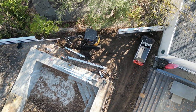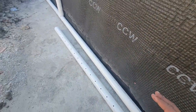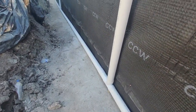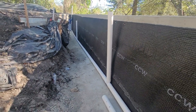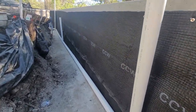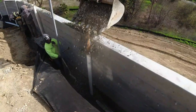So we got the perforated pipe here, and this is the SDR 35 pipe — this is what we use. We don't use that black corrugated pipe, at least not the commercial grade. We have a project coming up where we've got to use some 6 and 12 inch commercial grade corrugated pipe — I think it's called HDPE — but yeah, you guys probably know our retaining wall drainage system.